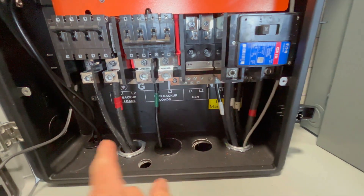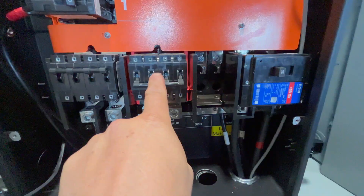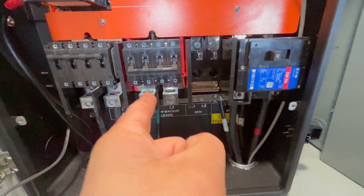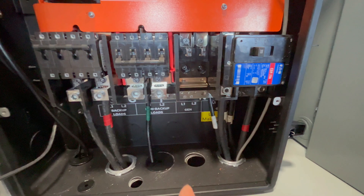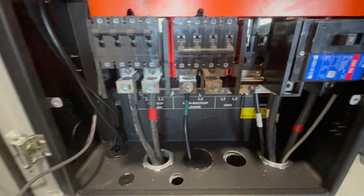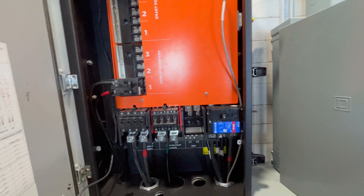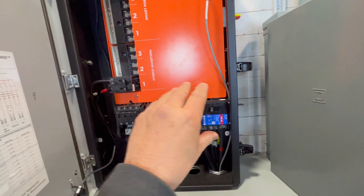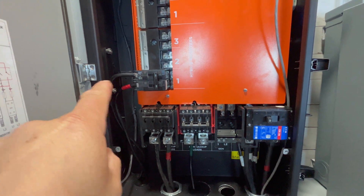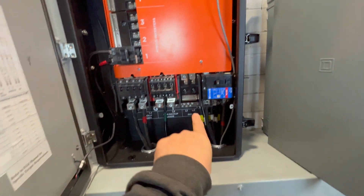The neutrals are connected in back, the ground wire is here, and the PDF has all the wire sizes and connection diagrams. This section here is for a panel that's fed only by the grid — if the grid is turned off, this shuts down automatically. I want everything 100% backed up, so I have it on the backup panel. Those two 3-0 wires feed into the gutter and come up into my panel. This is an MID — a microgrid interconnected device — where everything is centralized: the grid comes in here, and the two wires from the FlexBoss 21 also connect here.